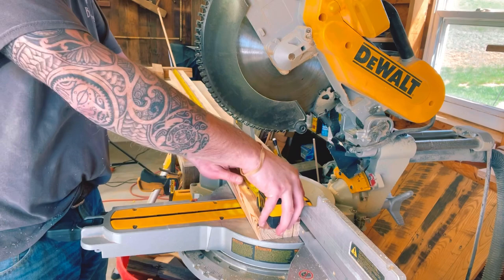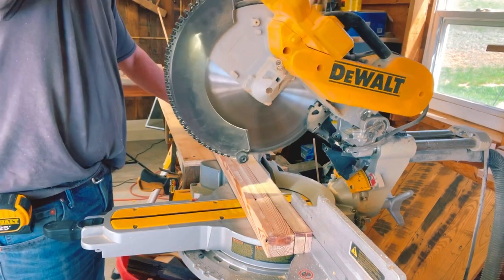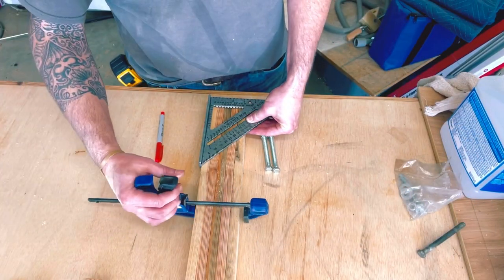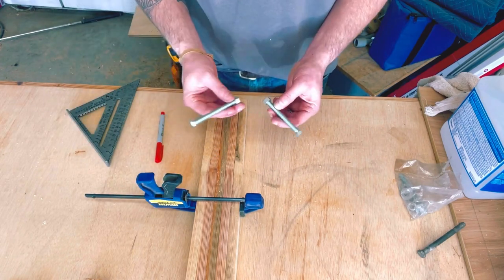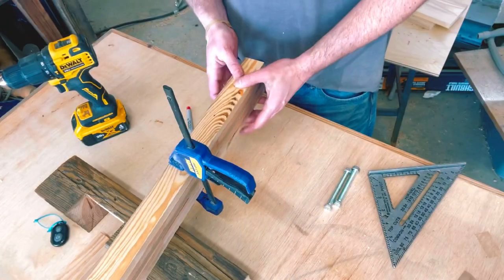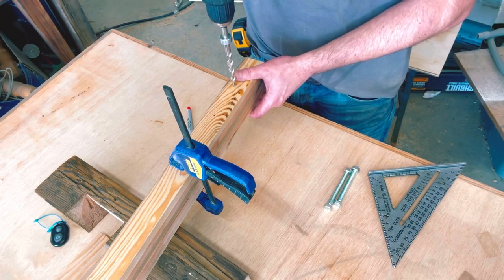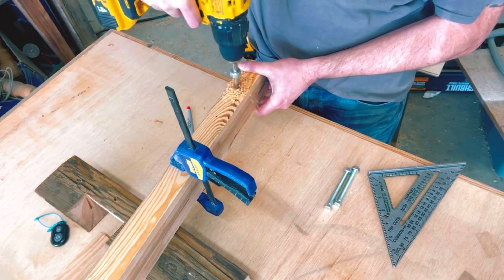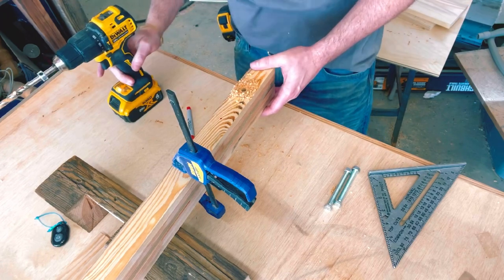Here I'm cutting down to my desired height of six foot. Now with five of your strips on edge, go ahead and place a clamp once you're square. This will make sure the boards don't shift whenever we're drilling our holes. I'm using four-inch bolts and I'm going to drill my hole roughly about two inches from the bottom. With them all clamped together, they'll line up.